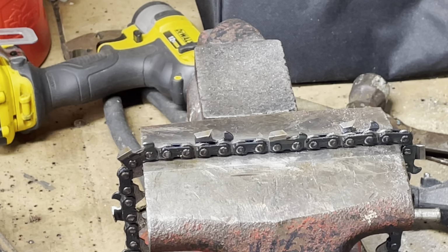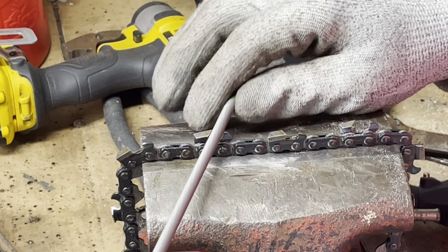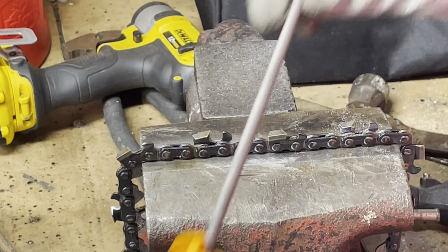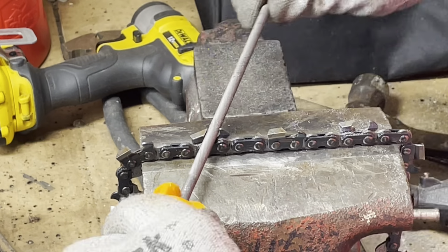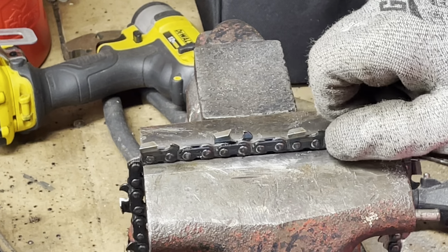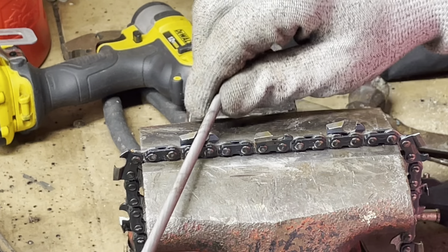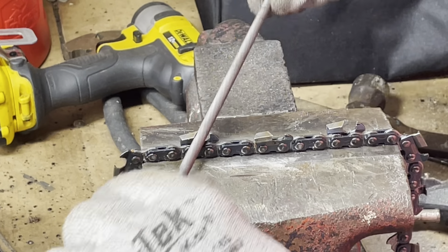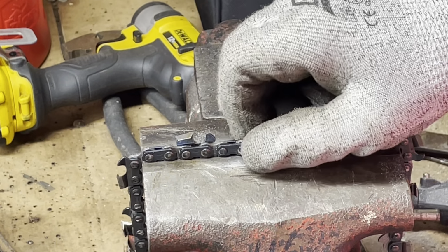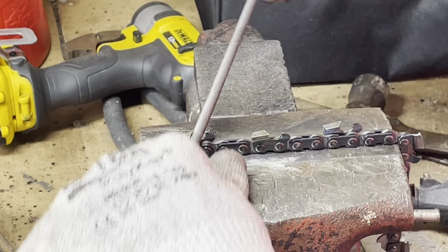I started filing it, and some of the teeth filed good. This is a fairly new file, and some of the teeth, it looks like I tried to start this one. I'm not going to ruin my good file, but I got an older file. This thing's hard as a rock. It's like it's got too hot. I don't think I got them too hot. I don't know why I would've. I didn't cut that much. It's every other tooth. This tooth bites good. Starts moving material. This one's decent. It might've been only 4 or 5 teeth, but still.